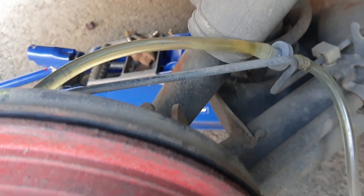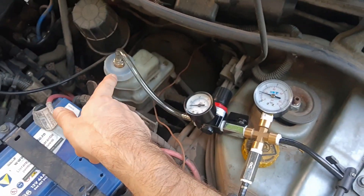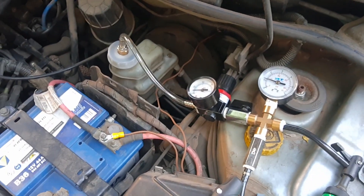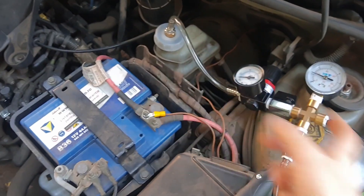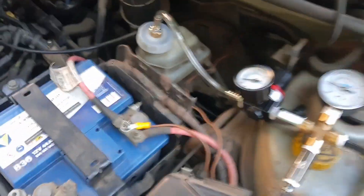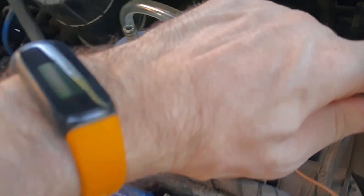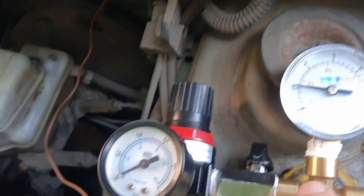If this was empty you would have seen it flowing, but I've just finished building mine so I don't want to do it again. This is how you do it — I will put links to the parts. It's much cheaper and easier like this. You just put your brake fluid in this bottle, tap it up, and you don't need another bottle. Just use the bottle you buy, tap this to the top, put this on, pump it, and keep the pressure. So you close the valve and remove it from here to release the pressure.